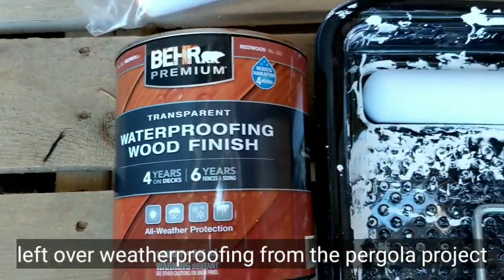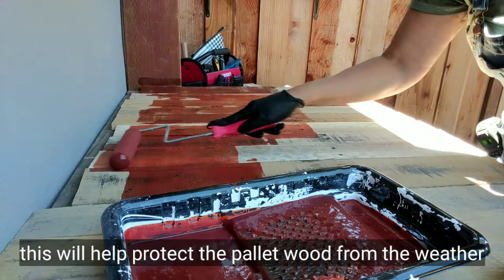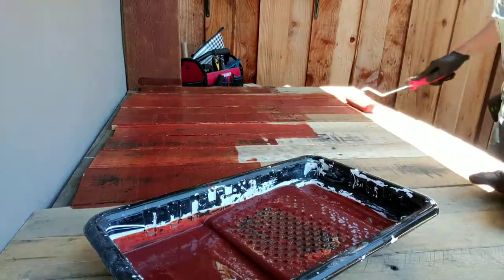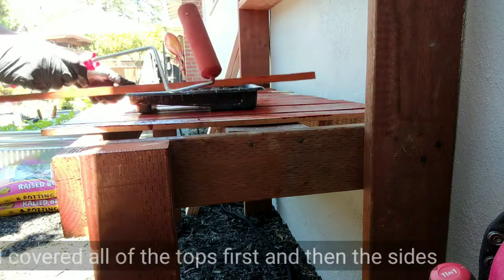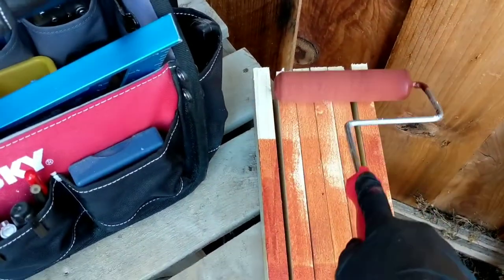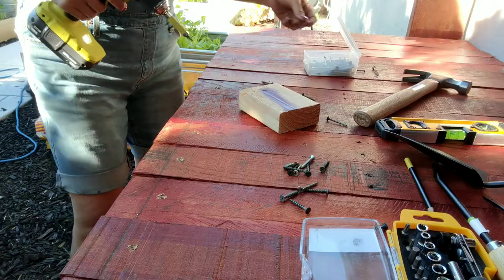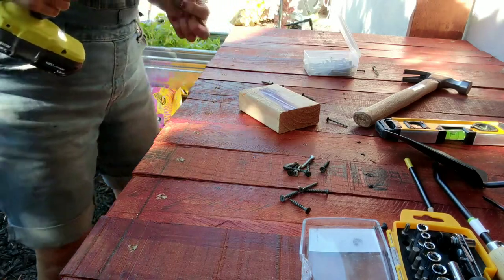We're using some transparent wood finish here to put some finish on these pallet boards to protect them from the weather. We used this on our pergola and it will help tie in the color to the pressure treated lumber we used for the frame. I didn't have a lot of wood sealer so I did the tops first, then the sides, and then whatever I had left I covered the bottom of the boards. We used a multi-material screw to screw down all of the pallet slats onto the frame, and I pre-drilled my holes because these were hardwood and I needed them to be a little bit easier to screw down.